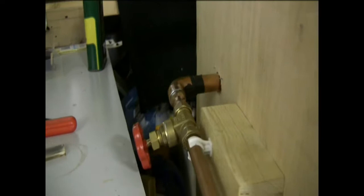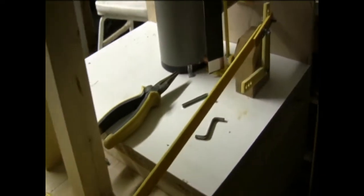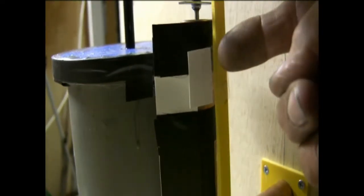So I put a valve on to try and control a bit of the pressure. You've seen the valve gear as rudimentary as it is. I've got an indicator just here that indicates where the valve is, and if that indicator is anywhere near accurate she should never run. You can see the crossbar at the top and the piece of card that I'm pointing at — that is the valve — and the valve will never drop down far enough for it to exhaust. So I just cannot fathom how she actually ran.